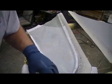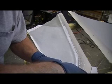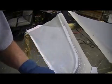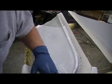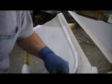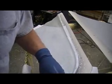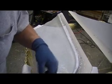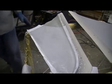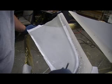You can type in 'peel ply' on your search engine if you're looking for a larger amount. There are different weights — I didn't like the lighter weight stuff because it wanted to tear too easy when you were pulling it out. This is the heavy stuff, the rip stop from Cloth World, and it works just fantastic.